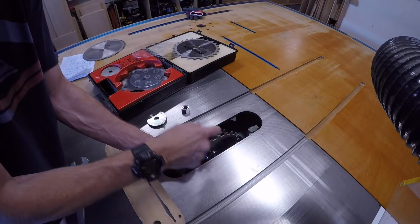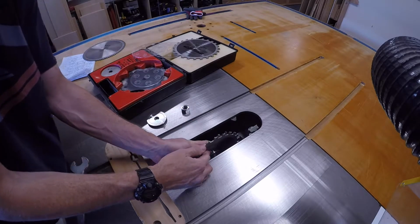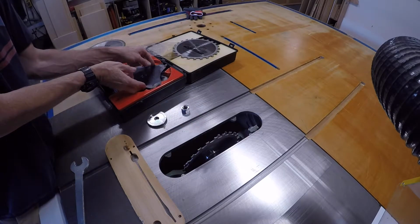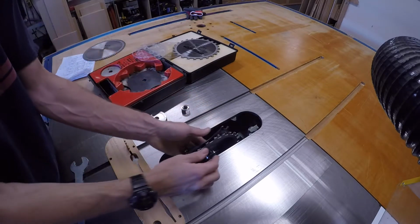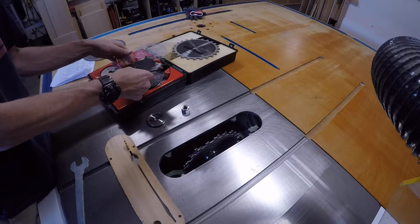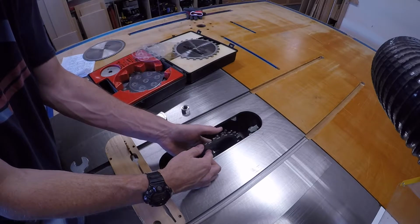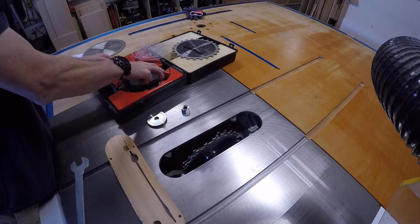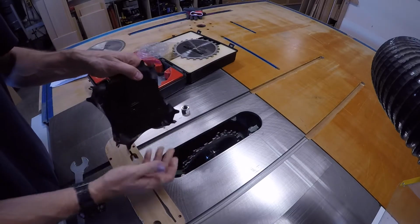And as you put it on, make sure that your teeth don't touch the teeth of the outside chipper, and just make sure that they're actually seated against each other nice and tightly. It's kind of easy to get them cross-threaded, so you want to make sure that they're nice and flat on each other. Now some sets have 2 teeth chippers. Some sets have 3. Some sets have 4. It just depends on the actual set.